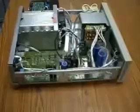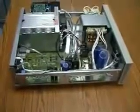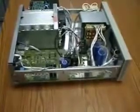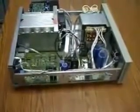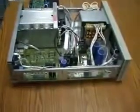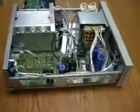That isolator board is required so the person using the front panel can't get into any of the secondary circuits. Some of the newer instruments manufactured after 2005, we changed the instrument just a little bit, so in some cases you won't see the isolator board. So to do this, it's a very simple technique.